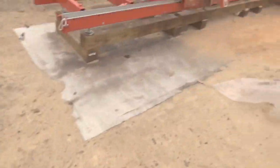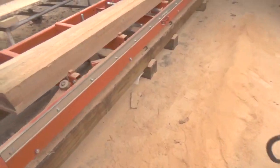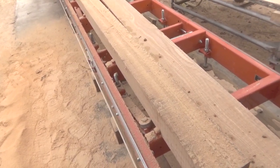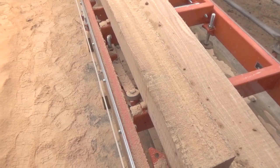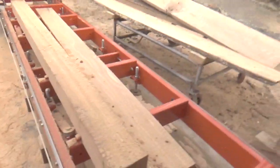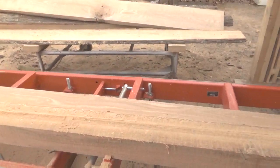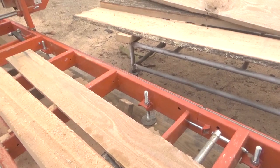The name of the game is trying to get number one lumber out of this stuff, and if you don't get that then you have a hard time selling it. And even if you're just using it yourself like most of the stuff I am — when I use it myself, I can cut that stuff out. Little things don't bother me. You're not going to have a table 8 foot long in most cases for home furniture or home decor, so you want to be able to work around that. Now you can see there's a knot coming up in the next two cuts, but then the rest of the board looks good on that side. I'm just going to keep cutting 1x6s out of that. I'm going to cut that one-by-seven down to a one-by-six as well, then I'll use the one-inch strip for stickers.